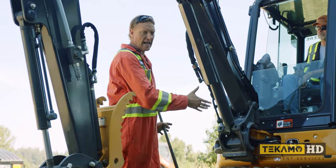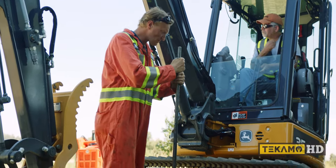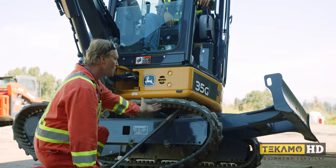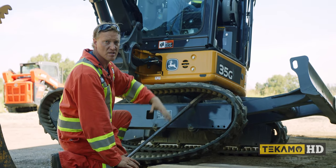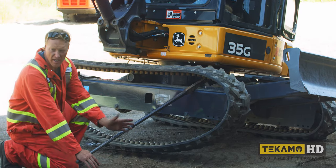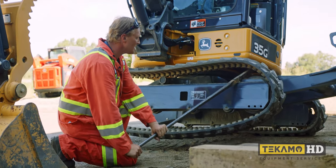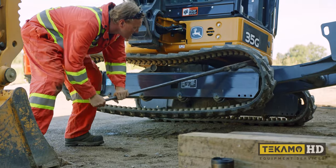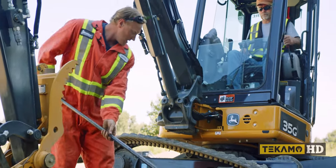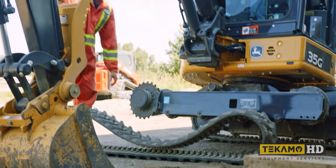That's all you need to do — the track is now backed off enough that we can pop it off. You need a bar — just a simple chisel bar from any local hardware or tool store. Have your operator fire the machine up, slide your bar just a little ways in, put pressure down to force the track off, then have your operator travel the track forwards and it'll walk itself off the front idler. Give yourself a little room from the bar in case it kicks — stay a safe distance but still hold on to it. As you can see, the track is off the front idler now. The back is fairly easy to pop off, and now the track is removed.